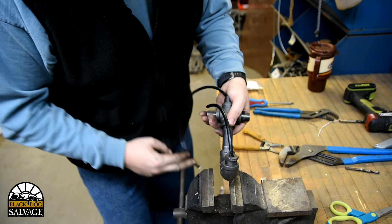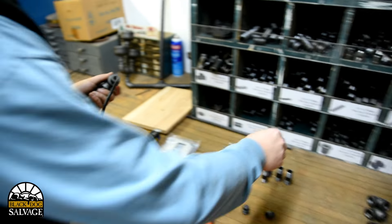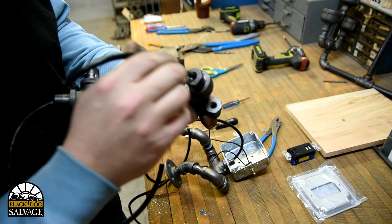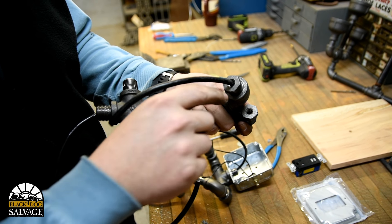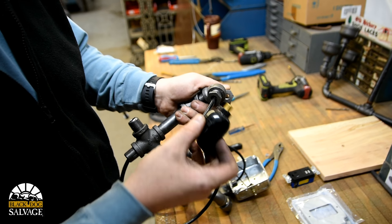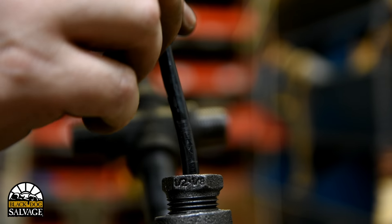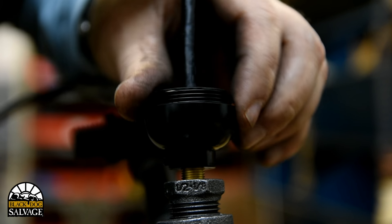What I just put in is actually a bushing. This is a half-inch to eighth-inch bushing. The eighth-inch opening is going to allow me to put in some IPS rod — which is a standard lamp rod that's threaded and hollow through the center — into this hole. Then I can attach this piece to our lamp. That is a very short piece of IPS rod attached to this socket, which is the socket we're going to use. It will feed right through there and screw right into place.